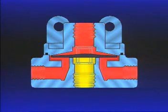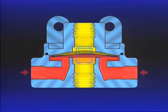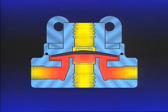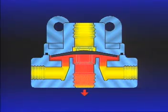When the brake valve application is released, the air pressure above the diaphragm is released back through the brake valve exhaust port. Air pressure beneath the diaphragm lifts it, opening the exhaust of the quick release valve. This allows air in the chambers to exhaust at the QR1 rather than traveling back to the brake valve.